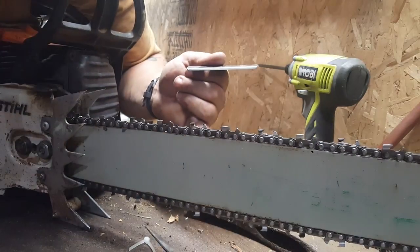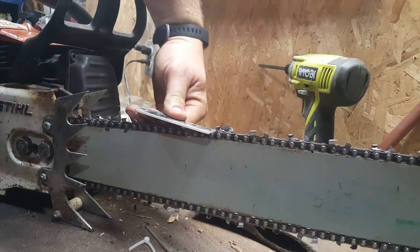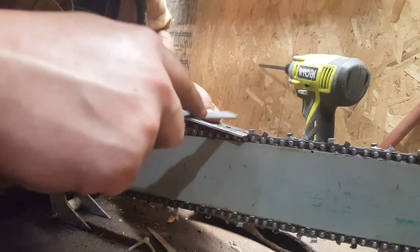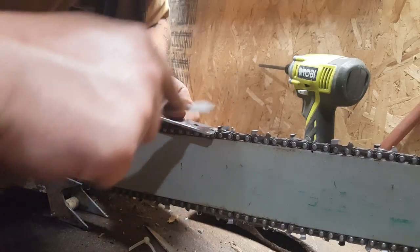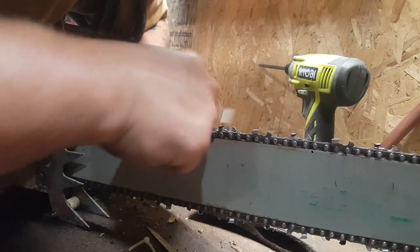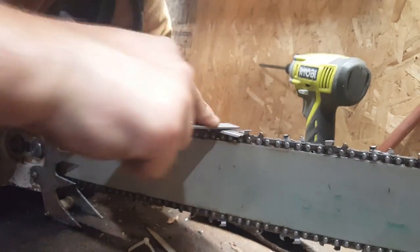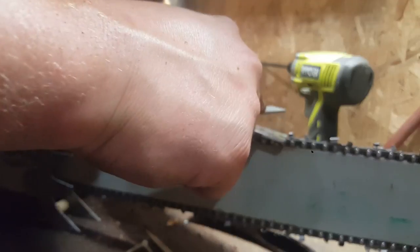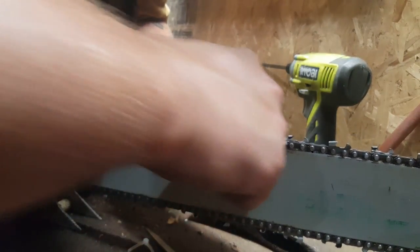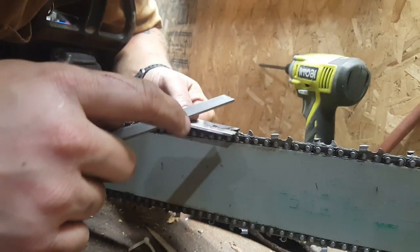But now my wife and daughters got me my own grinder, and plus, like I said, I've learned a fair amount recently about them. It's just kind of funny, as your skill level and knowledge improve, this is like a step back in time. I was grinding this, looking at the inconsistencies of the angle of my hand file, the lack of cleaning the gullet out when I filed it, and just the fact that this chain is three-quarters worn out. The rakers have never been touched.